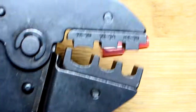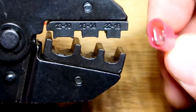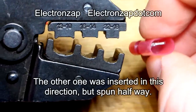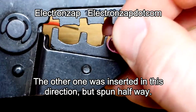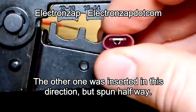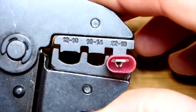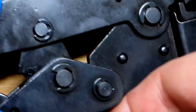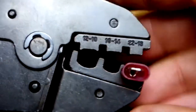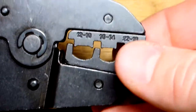Now I have a new crimping tool — this will only be the second time I've crimped one of these. I'm going to try putting it in this way; last time I put it in the other way. We're going to be using 22 gauge wire, so you can see 22 gauge there. It is ratcheting, so it's kind of locking into place. There is a release lever here if need be. We can ratchet it down to help hold it in place.